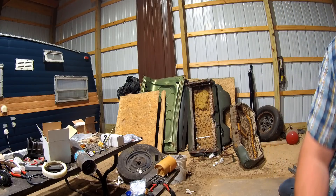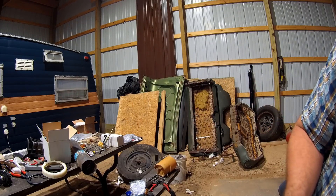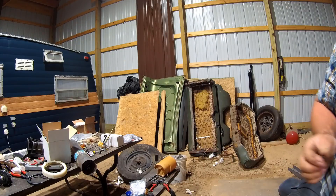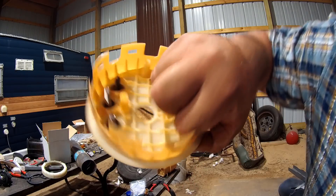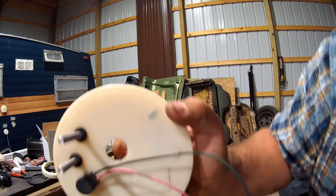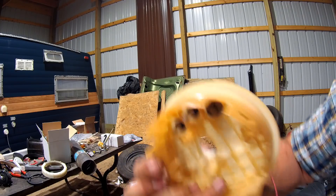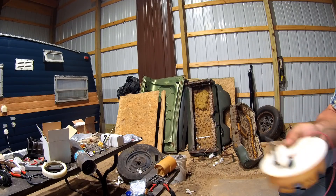After about the 5th or 6th hardware run, I have some more stuff. These are stainless steel studs. You can see I've got them anchored in with grommets, which are a quarter-inch grommet with a 9/16 opening on the outside dimension. What I plan to do is put a washer on either side and wedge them down until it's airtight. Then I'll put the wire eyelets on the inside — they go down to the pump — and the wire eyelets on the outside, then nuts, etc. Obviously I'll cut the excess off.